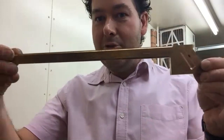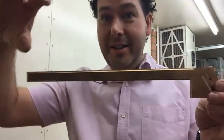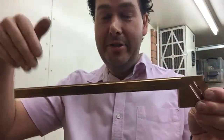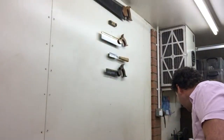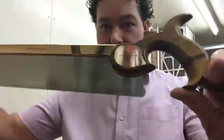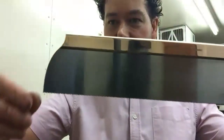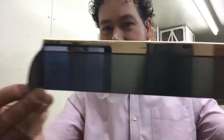So it works very much like if you're running your bandsaw loose and then tightening it up as you're putting wood through it, you'll see it cuts and it sings much better with a tighter blade than it does with a slack blade. So that's what this does. Now the Mallard saw, which is this one, uses the same idea. This is side plated. And the reason we call it the Mallard is it's shaped like the front end of the Mallard train.